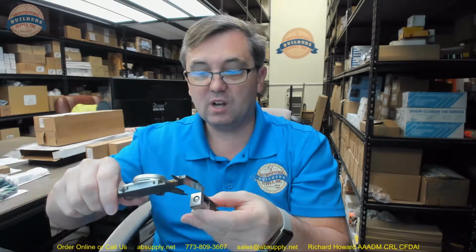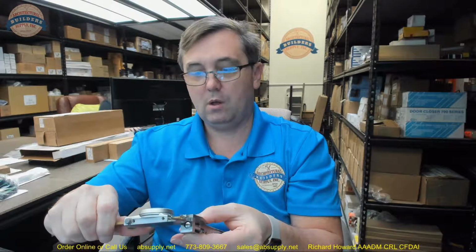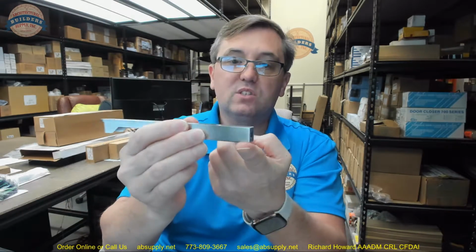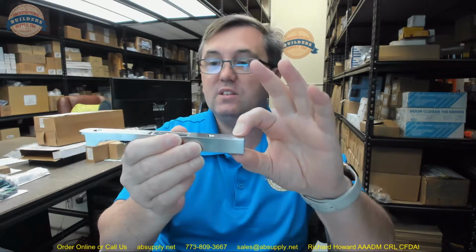Overall thickness of this item, 0.62 inch over here. Down over here, about 0.612 inch. Yeah, about 0.612. So your depth is going to be 5/8. Something right in that range. You're going to want this to obviously be flush. It's probably going to rock a little bit. So I would test with a 5/8 depth on a 3/4 inch diameter bit, a single prep, and you're done. So that's what this is for. So very simple and straightforward.